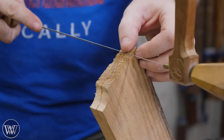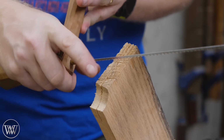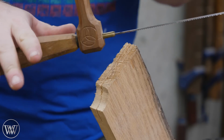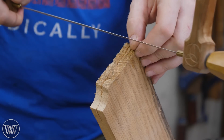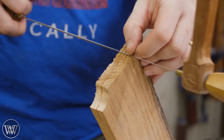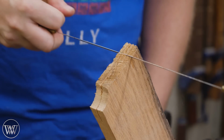When starting the bow saw, I'm going to do much of the same. I'm going to tend to hold the handle a little bit more because it gives me more control. Just like having this as the horn to hold up the weight, I find that if I hold it more like this, I can hold that weight off, and I can scratch the surface very lightly, get it where I want, and then cut into it.